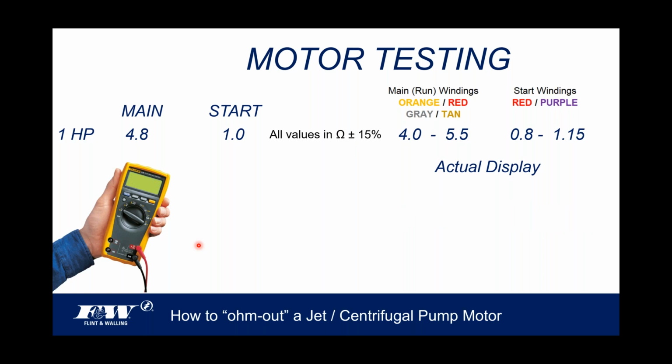All right, so here's another one. Another one horsepower motor. There are your published values. If I put my probes again on that orange and red, I get 4.8. It's within the range. Good grade. Now I move down to the gray and the tan. What am I going to get there? 4.2. There you go, 4.2. Well, again, that's within range, right? All right, so I'm going to move to my start windings. I'm going to do a test over there on the red and the purple. So in doing that, I come up with,